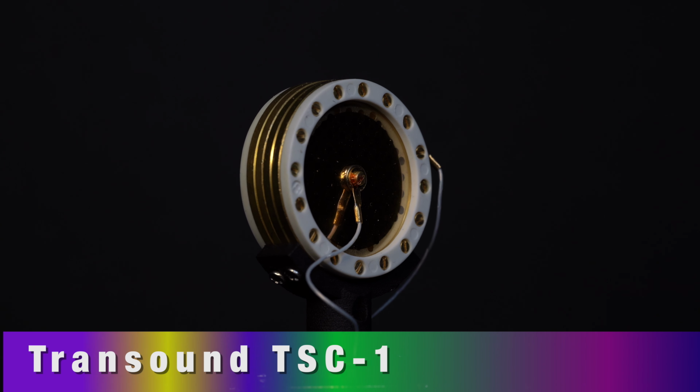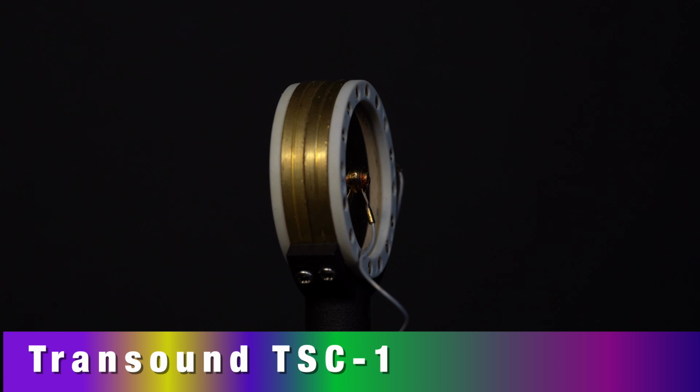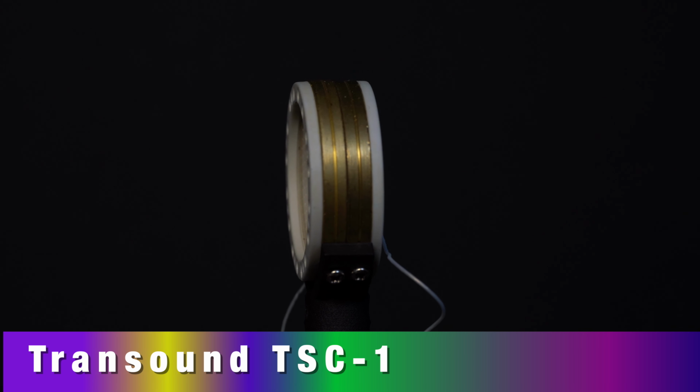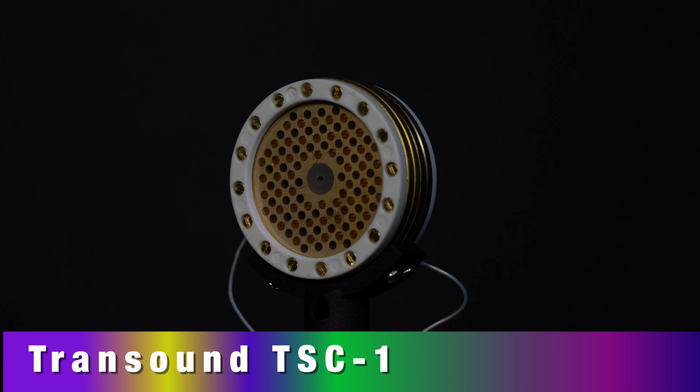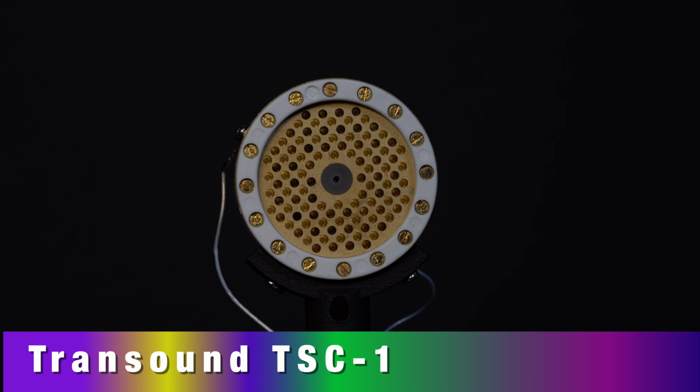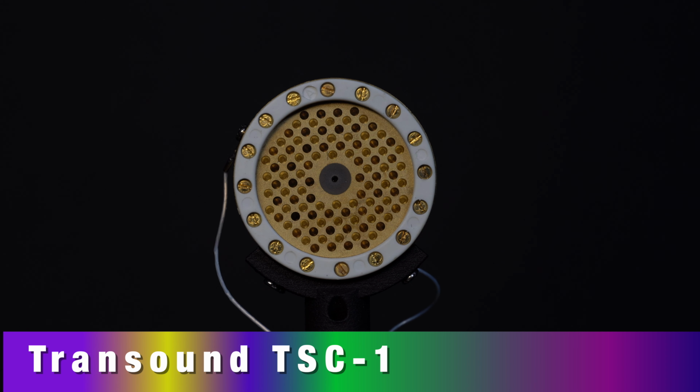Okay, this is the TSC1 capsule. The front diaphragm is center terminated so that we can get the signal off of the capsule. And then the rear has no electrical connection, and this one you can actually see through to see the precision machining that goes into the brass backplate.